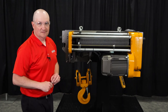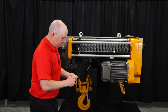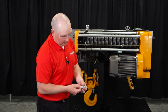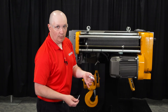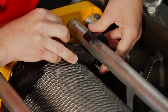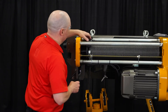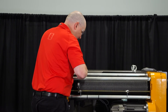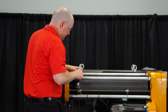Now we can begin installing our short socket head bolts. With the short socket head bolts installed, it's time to bring the Rope Guide together and install the longer socket head bolts. Notice that this shim set has four shims — you will install all four. It incorporates one hole and one slot, which allows you to install one bolt and let the shims hang off of it until you install the other bolt. Here's where the spring pressure is applied to the rope. It isn't much pressure, so you can use one hand to pull the guide together while you install your nut. Remember, these are captive nuts, so just slip them into their slot and then tighten your socket head bolt.